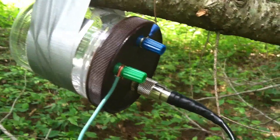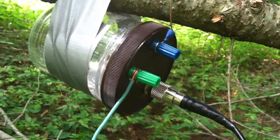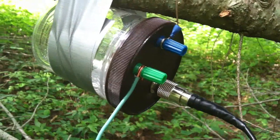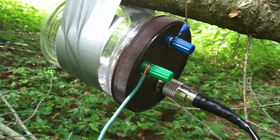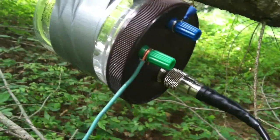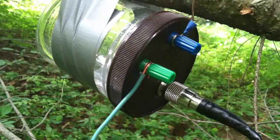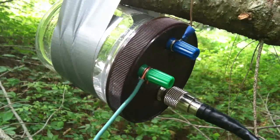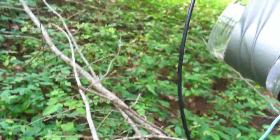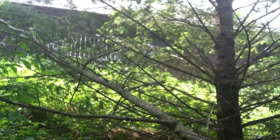Here's my portable antenna setup for my 2013 Michigan trip. There's the balun with 44 to 6 turns on an FT-114 type J toroid. The antenna is connected to the blue binding post and the ground is the green binding post, and there's the coax — RG-174 coming out — that goes back up to the cabin about 40-50 feet away.